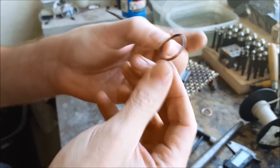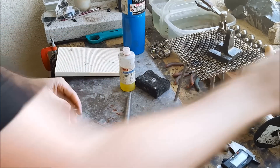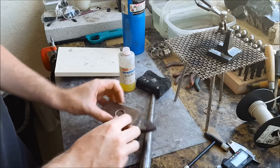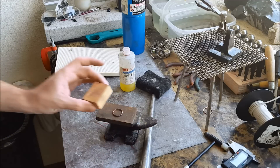Let's make this an actual ring now. After you've hammered it on here with your soft hammer, go get a piece of wood and hammer it flat — see how it's a little wavy? You don't want that, so start hammering away.